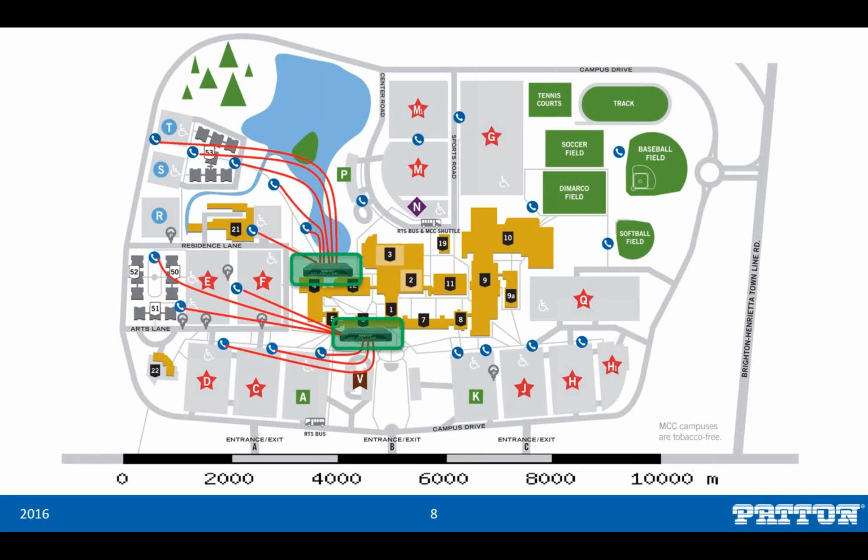So highlighted in these green items here, I placed the smart nodes. Those smart nodes would address and connect the phones that are on remote sites of that campus, and really each phone can be as far away as up to 6.2 miles, 10 kilometers, and still drive line power for the telephone to ring. That's one thing, but of course also to be able to do phone calls. So that example here could be for phones being used for emergency kind of situations. If there is an emergency somewhere on the campus, these phones can be used.